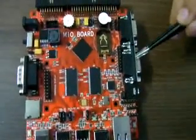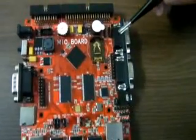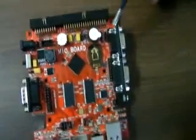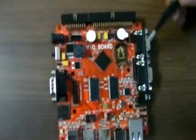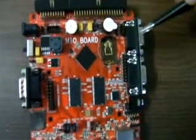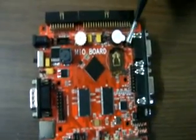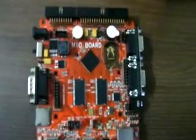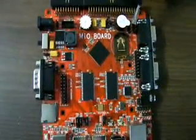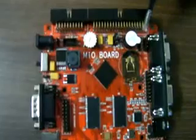This is UART2 and this is UART0. These two are used for serial communication — that is RS232. You can also program the controller using ISP mode via UART0. The corresponding TTL outputs are also given here.